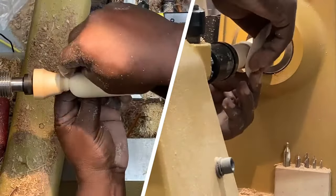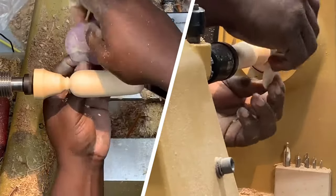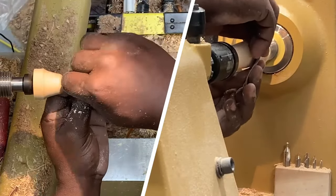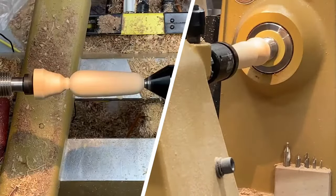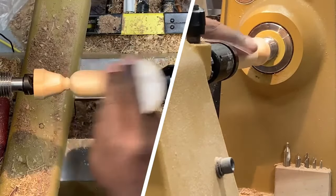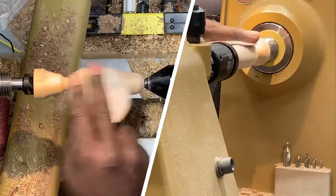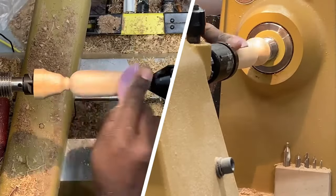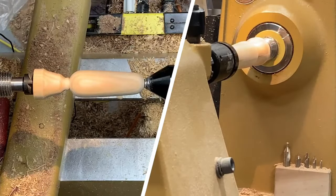For these things, I don't need a pristine surface. I certainly don't want to get any splinters from it, but I don't really care about getting a pristine surface. And also, resist the urge to do a shiny film finish, because you really want to be able to get some grip on these things when you're trying to tighten them. If you put a glass smooth finish on there that's been wet sanded and buffed and polished, it's going to be real hard to use these as clamp handles, because you won't be able to get a decent purchase on them as you're tightening them down. So I'm going to just use a little bit of wax on it just to give it a little bit of protection, and hopefully it'll age nicely over time. So all right, we're pretty much done here. I'm going to go ahead and use a little bit of wax.